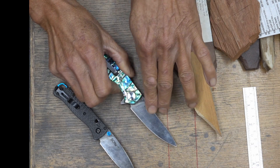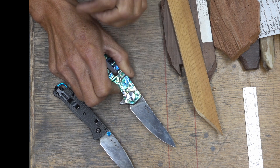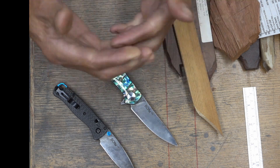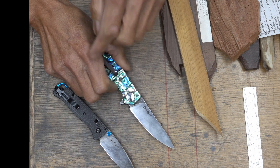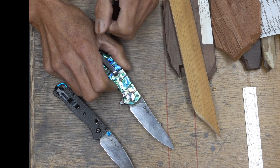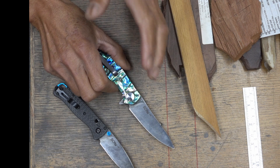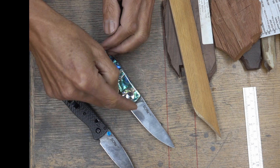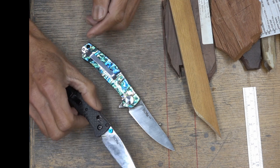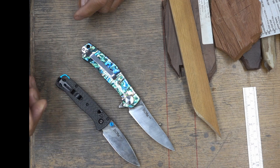While I re-hardened it, I did it alongside an N690 blade, which is about similar to VG-10, and that one got 63 Rockwell. When I scraped them against each other, the N690 cut this one. The edge of this one scored 60 Rockwell against the edge of this one. So this one feels like about 62, and this is 61.